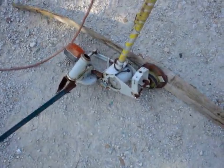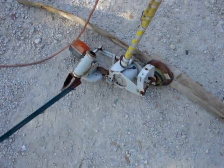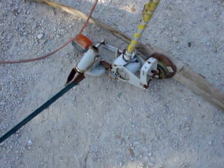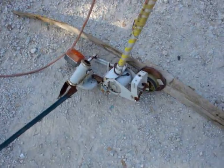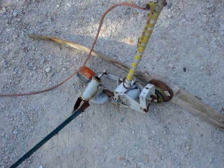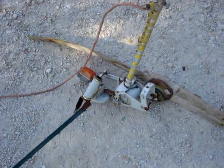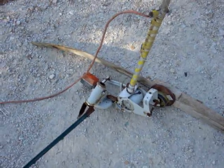Always, when choosing a motor for your wind turbine — whether it's DC or whatever — look and see how many RPMs per volt. It'll tell you how many RPMs it's supposed to be and what voltage the motor is. Take the RPMs divided by the volts and you'll know how many RPMs it's going to take to get the charging voltage. At that point you need to exceed charging voltage — five or six volts is wonderful for something small. For a bigger one, go a little higher. If it's got really low RPMs, consider going to a 24-volt, 36-volt, or 48-volt battery.